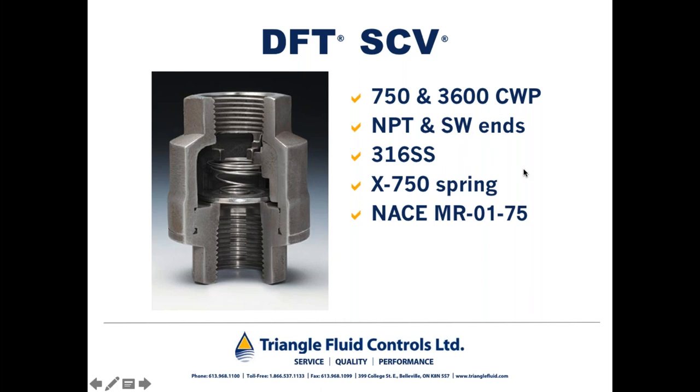It's a full stainless steel construction, features an Inconel X750 spring, and complies with NACE MR0175. Popular applications for these valves are small condensate return lines, boiler feed water lines, and another kind of non-slam application, a very popular valve for systems that operate on low pressure fuel gas. They love this valve because it features a very light cracking pressure, which allows the gas to go by and prevents fuel gas from backing up into the system.